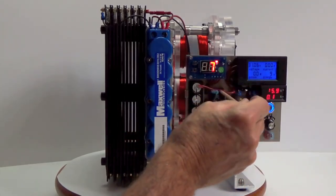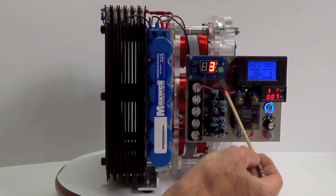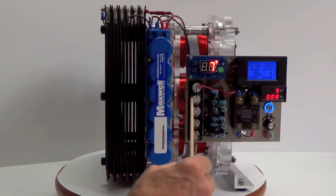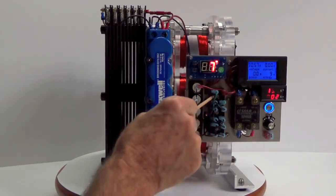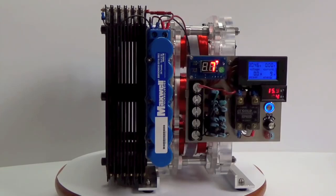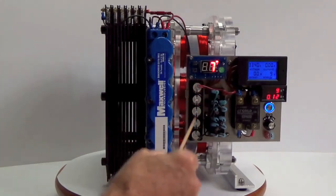Each one of these really is about 32 volts, which is going to give you, let's say, 96 volts from all 3 in series. But these super caps here on the control panel are what power all the instrumentation, all the digital stuff. They're 5.5 volts each, which is 27.5 volts overall. These are connected to just this top bridge rectifier. If that's 32 volts and you can only load these up with 27.5, you've overloaded the supercaps, and you're going to shorten their life. That's stupid. Don't do that. So if you keep it at 65 volts of output or less,